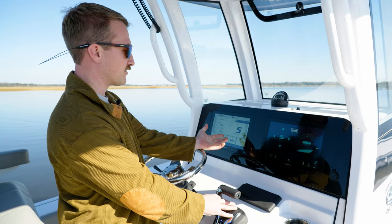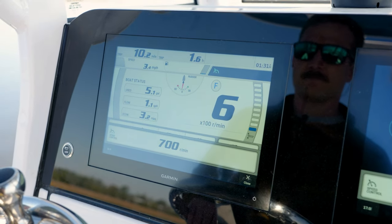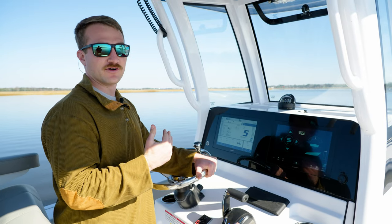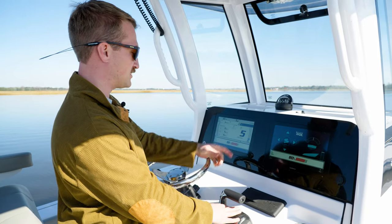So I engaged it at 600 RPM, so that'll let me take it up to 1100. Obviously I can't get much below 600 RPM, because if I do, the engine will not run. So once I get below 500 RPM, it'll go into a pattern shift feature, which is great for slow speed trolling.